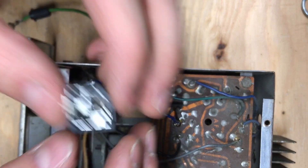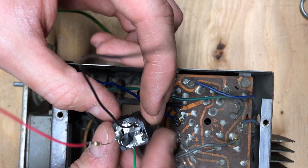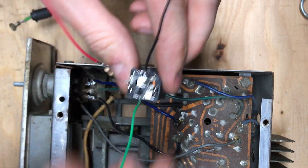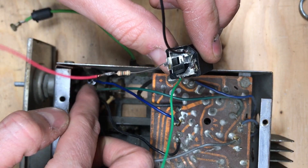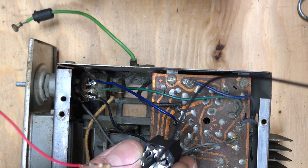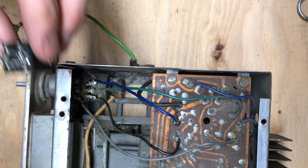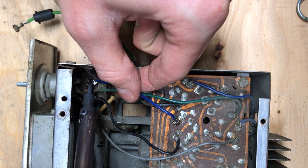To make this simpler, I've already soldered on some leads. Black will be ground. Pins three and four with the resistor will go to the potentiometer input, and pin five will be the old AM antenna. First I'll disconnect the AM antenna from the potentiometer.